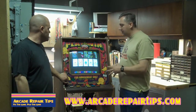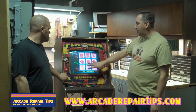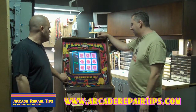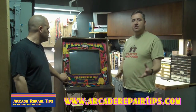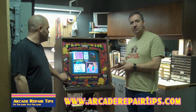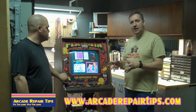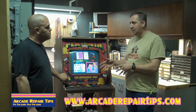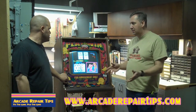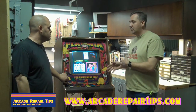Replace it and go from there. I soldered in the transistor for the blue drive - and wow, look at that - the blue is back! We've got white and the monitor looks great again. One key lesson: if you're not getting a certain color, it's a real quick way to check your tube - it doesn't take but a couple of minutes - and you can eliminate that right before you start digging into the chassis and recapping and all that.